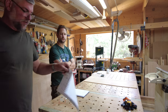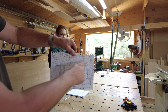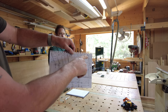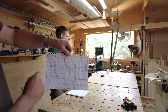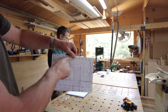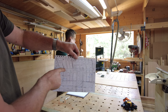Here's a rough sketch of what we're doing. We've got 11 rafters going throughout the top and a back plate to the house — it's actually a bungalow. We're taking the existing guttering off the back plate. The roof overhangs this, there'll be lead on top, and all the water will run down over onto this roof and into guttering we're putting on the front.